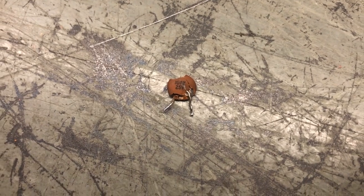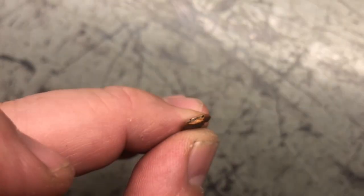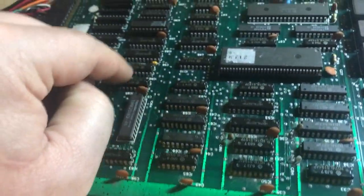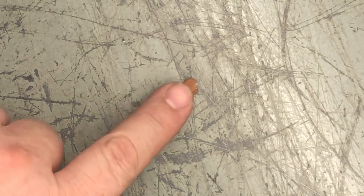If you look at the top of the capacitor, the top was smashed and the two halves were sandwiched together and folded over, shorting the power and ground rail. This is just a little filter cap — like all these little filter caps for the chips. They're just filter caps for the 5 volt rail, but this one was shorted. I'll zoom in so you can see.